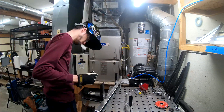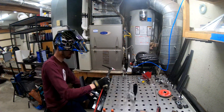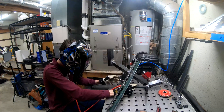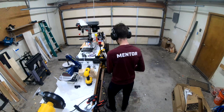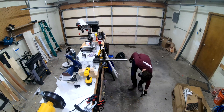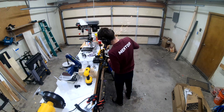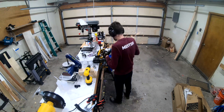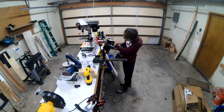I'm using filler rod to help me build up more material in the corner of these welds. Certainly not an expert TIG welder, but I've made myself dangerous before. Then I get this other side angle bracket on — this is for the other front leg — and I weld it up pretty much the same way. Now I'm getting ready to do the back leg attachment points, and this is actually quite a bit trickier just based on how I designed the pad. Grinding these angles is much trickier than the front two because these angles need to be perfectly symmetrical so that the leg goes out straight to the back, and they need to sweep at the same angle as the other two. That's really tricky to check.